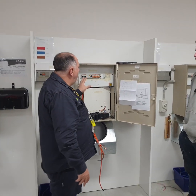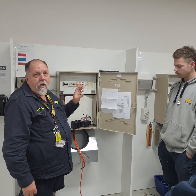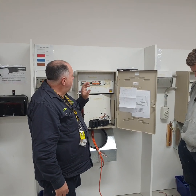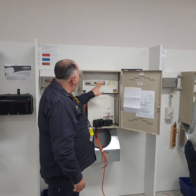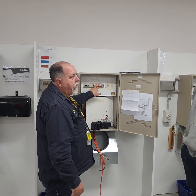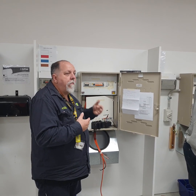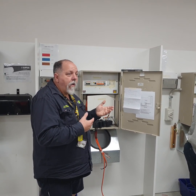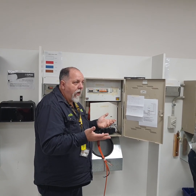What I'm doing is I'm looking at this from somebody who's going to mark it from an LEP point, all right, in the LEP. So some of the things that Gordon did have wrong, which now we have corrected. For example, he had 32 amps on these two of the breakers here, because when he looked at cable C9, he was looking at 2 amps per point. He had 8 power points, 8 doubles, and it made it 32 amps.